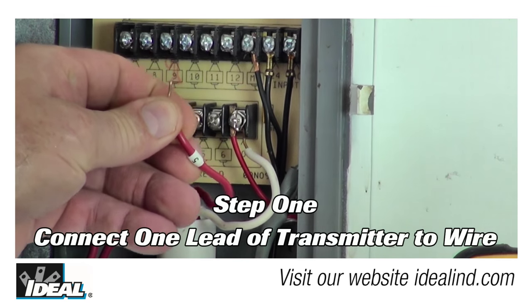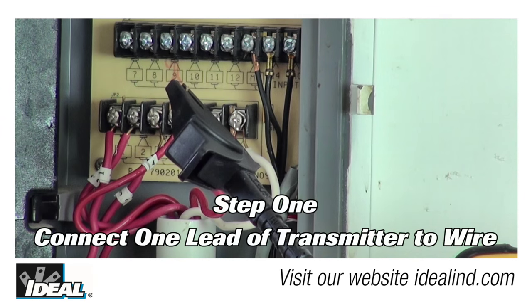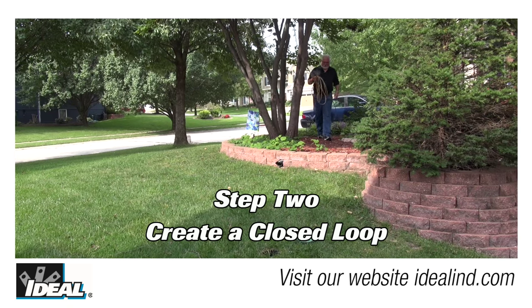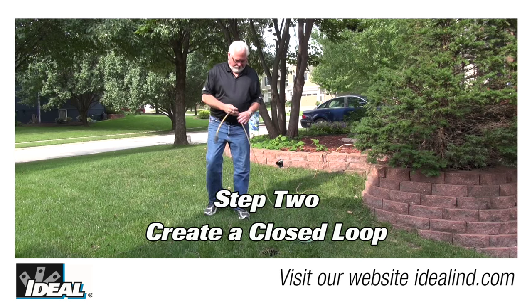To do so, I will disconnect the wire that feeds valve 5 from the control port and connect 1 lead of the transmitter to it using the alligator clip adapter included with the SureTrace kit. Step 2 is to create a closed loop by connecting the other lead of the transmitter to the other end of the hot wire that feeds valve number 5.